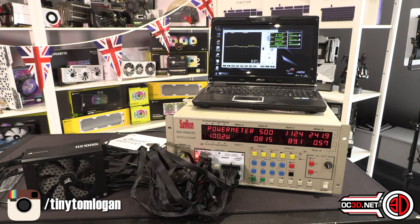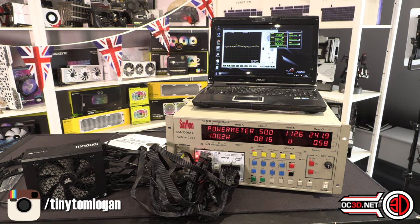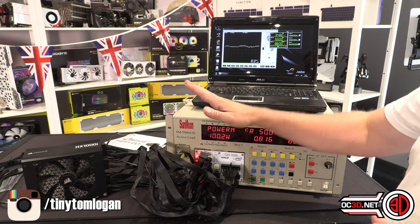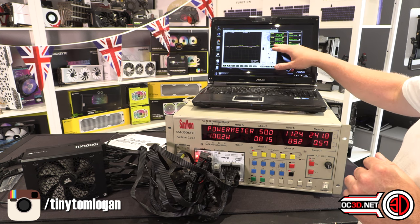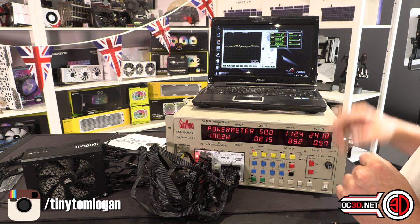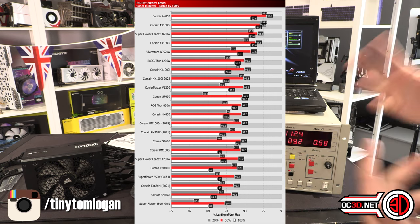This is the first time I've seen an all-digital Corsair power supply outside of the top-flight AXi series. At 10% load — 100 watts — that represents very light usage. The tester also shows ripple up here, which is the fluctuation of the voltage. We're turning AC from the wall into DC, and there's always going to be a tiny fluctuation. Too many millivolts of fluctuation is bad — we do not want too much ripple.